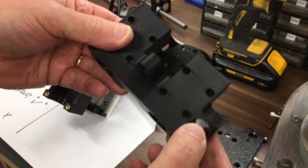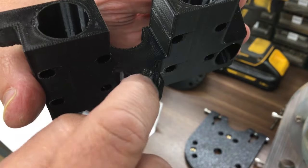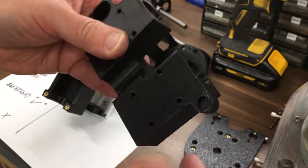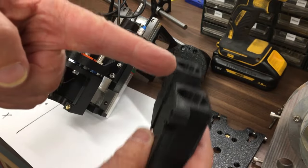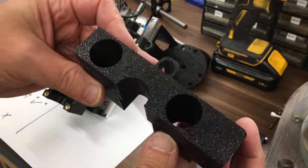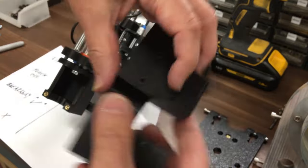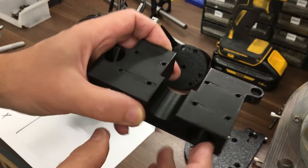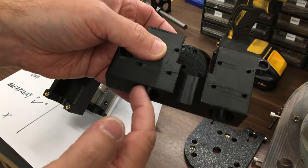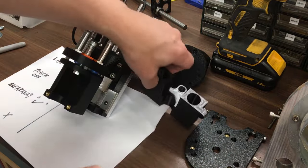That's to get the cable harness in. That's for the proximity sensor. The other thing I'm experimenting with, you can see, I've actually tapped that M12 fine, so let's see how well that holds up. And then that one will have a little nut in it. That's going to be the proximity for the home. So all that stuff in there. Oh, and then the ball screw. Oh, I need to just take those out. There's three little holes there for the ball screw to screw in. So the ball screw will be permanently attached to that, and then the lift or touch off will just be via sliding those very easy to move rods in there. Okay, so that's that bit.